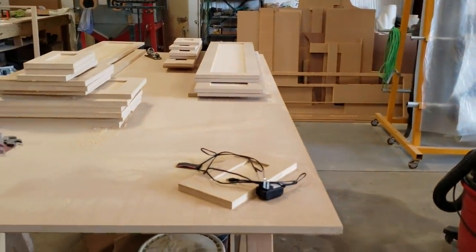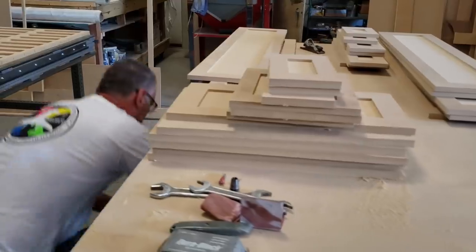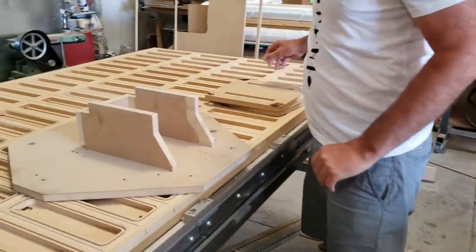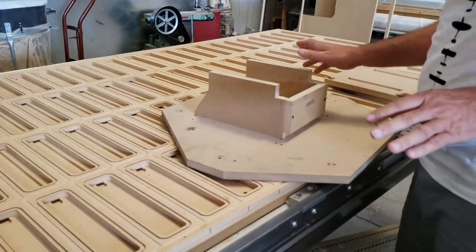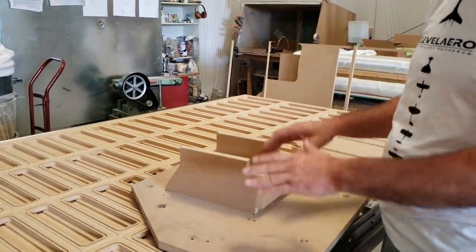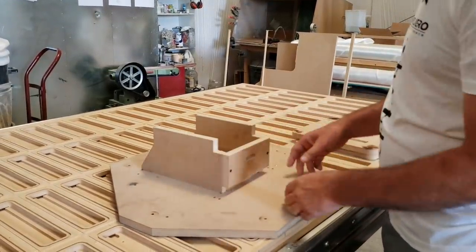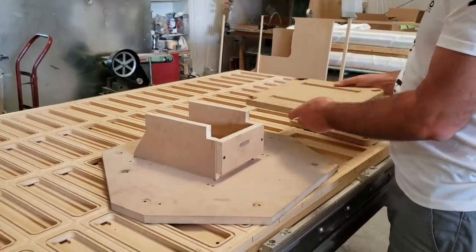This wood is primarily for pattern making, but also sometimes for short or limited-use fixtures. For instance, five days before Oshkosh, we got an engine in from D-Motor. We had no engine mount. But I had the CAD model for the engine in our airframe, and I was able to mate them up and create the engine mount in between. We used the CNC router to produce the pattern from which the engine mount was built up — this held all the chromoly tubes in place while they were being welded. Jigged it up for welding.